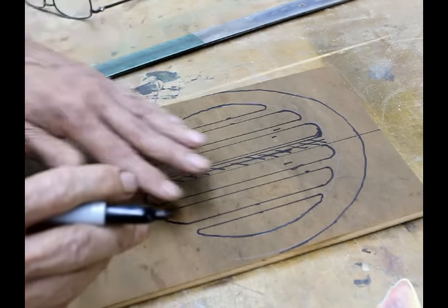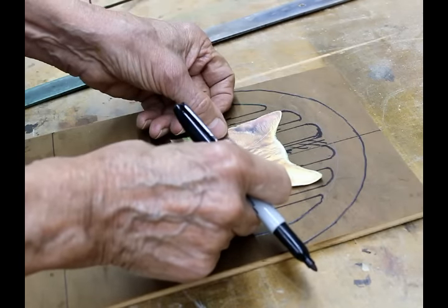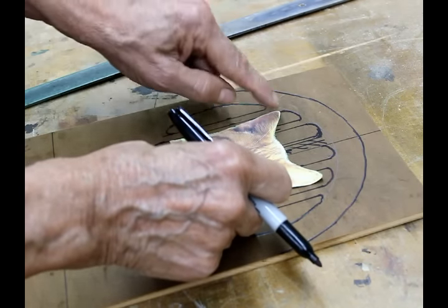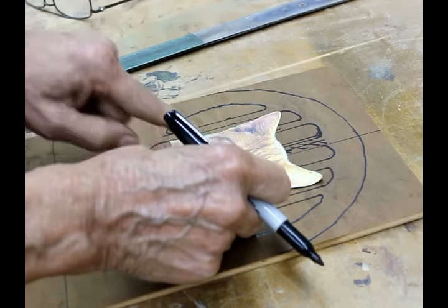All right. Now, that gets our grill work laid out. And seeing our kitty will be able to fit right back in there, and his eyes will show through, his ears will show through. The only thing it won't show directly is his nose. But that'll be okay. You'll still see a kitty very well in there. Okay. Now, the next thing we have to do is we have to cut all this out. All right. First, we drill holes in here so that we can get the scroll saw in. Well, I guess first we'll go ahead and we'll cut the size.